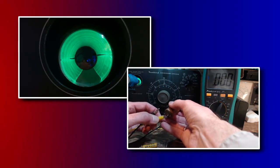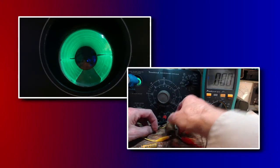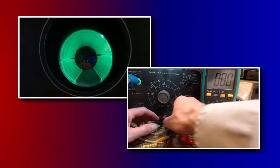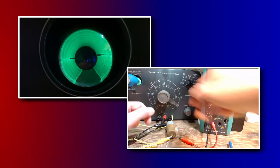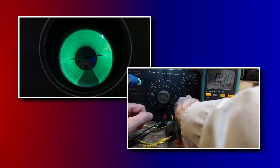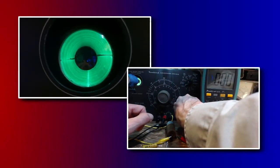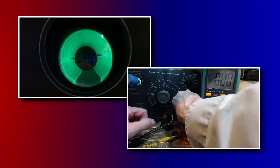Okay, we'll put on this fat guy here. Now, of course, this test is applying a high voltage to the capacitor. It is charging it up. It is going to charge the dielectric a bit. It does, when you release the control, put a short across the capacitor to discharge it, but it's only as long as you keep the leads on. But that will work. So here we go. 25. It's already slow at 25 volts, but it made it. Okay, 150. Maybe a bigger capacitor, it might just go a little slower during this test. 250. Here we go.